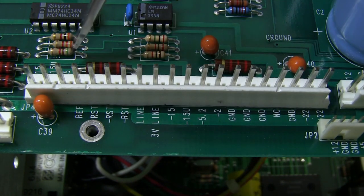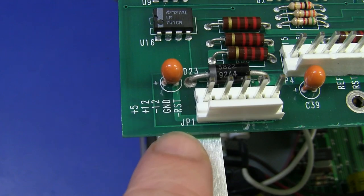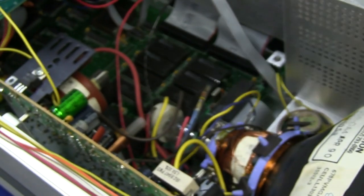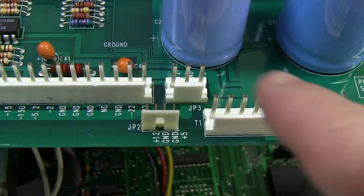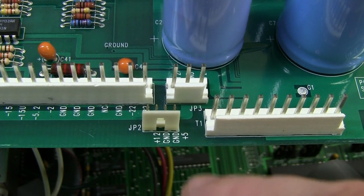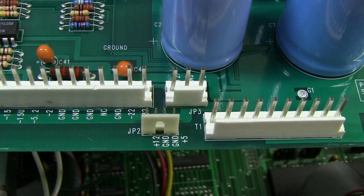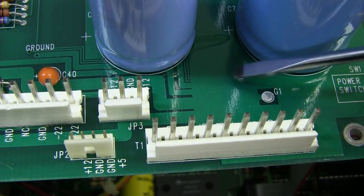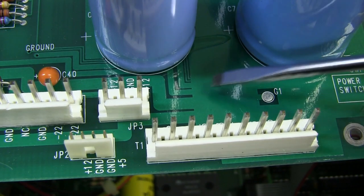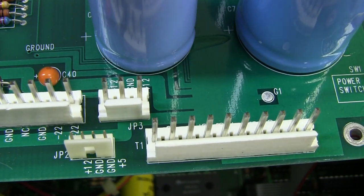Over here we've got plus 5, plus 15U and plus 15. This one here with the plus 5, plus/minus 12 — pretty basic stuff. The reset line goes to the main processor board under the CRT. The transformer input is here; this one goes off to the floppy drive — that's the plus 5 and 12 volts for the 3.5-inch floppy. And this one here goes with plus/minus 12 and ground off to the CRT driver board. You can see the star ground configuration — a huge ground plane with all the various boards just tapping off the same point.